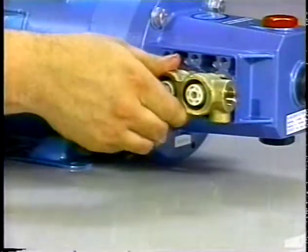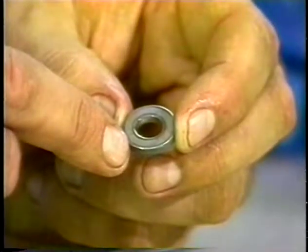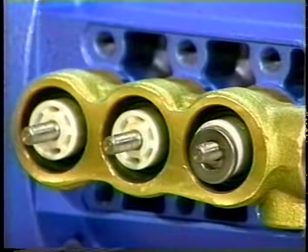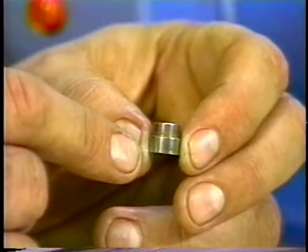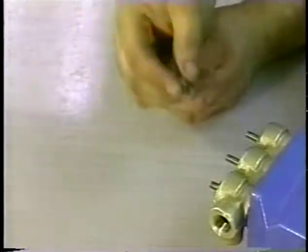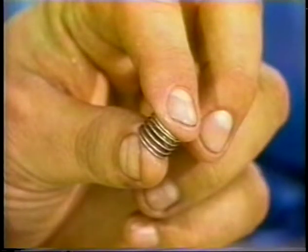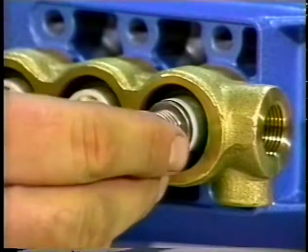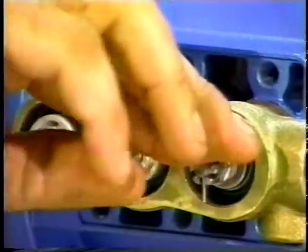Carefully install the inlet manifold over the plunger rod ends and press into the crankcase. Examine the inlet valve for pitting, deformity, or normal wear and replace. Install the inlet valve with the flat side toward the ceramic plunger. Note, the standard inlet valve is stainless steel, while the special high-temp pump models use a special nylon inlet valve. Examine the spacer for wear and replace as needed. Install the spacer on the plunger rod with the smaller diameter end toward the inlet valve. Examine the spring for damage or fatigue and replace. Place the spring over the spacer and then the washer with the concave side toward the inlet manifold. Thread on the nut and torque to 55-inch pounds. Always install new cotter pins when used and turn the ends to secure.